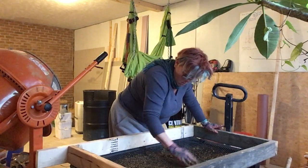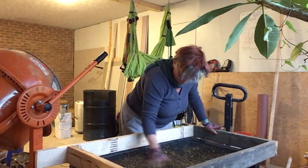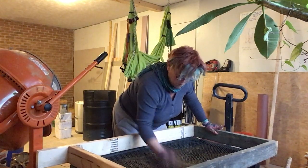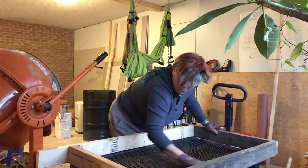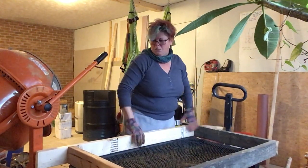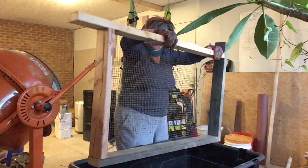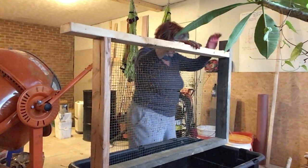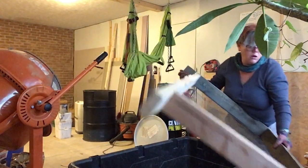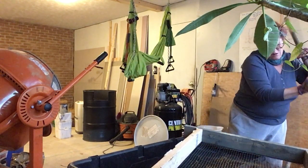That's somewhere that's going to be, on average, you know, it'll rise up to 400, 450 degrees, but it'll on average be around 300 degrees. And at that temperature, you can run water fluid through there at a reasonable flow rate and really not have a very high risk of that boiling. As you know your system and your flows, you're going to probably want to move that coil higher and lower in that chamber. Stratification plays a big role in the temperature of where it is, you know, what's going on inside that chamber. So there's a lot of ways you can tune the stove just by moving that around.